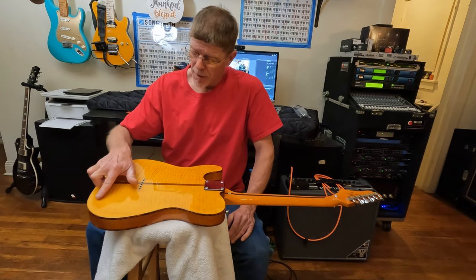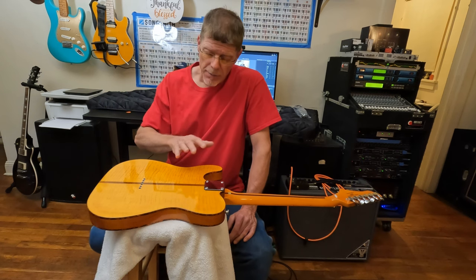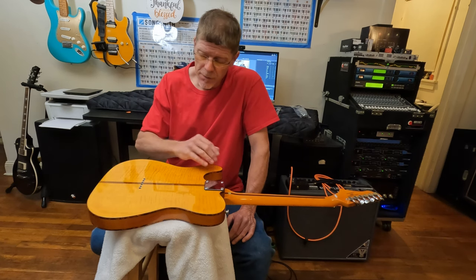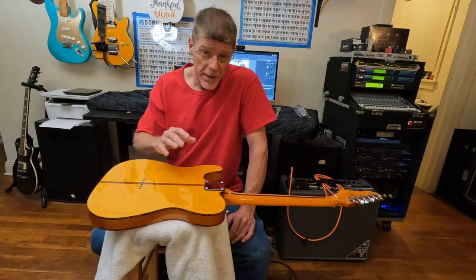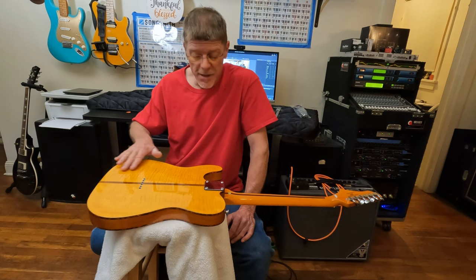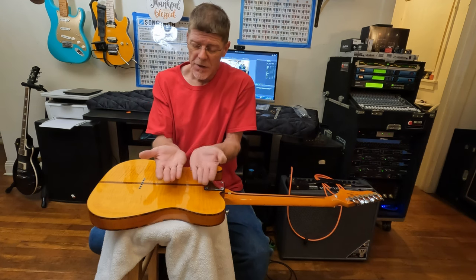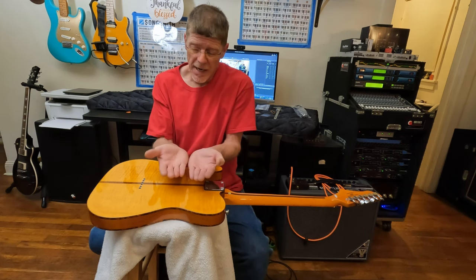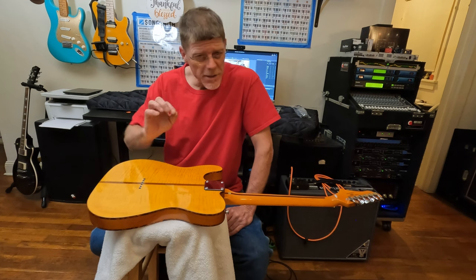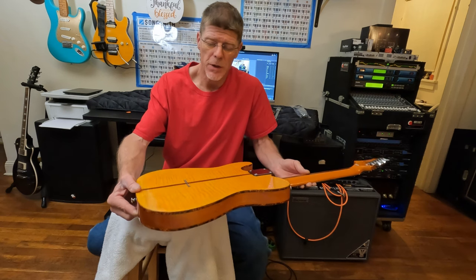I do woodworking. This spot here and these spots in here, I'm not going to say it's a finishing error. Sometimes on these flame tops, when you sand them, certain areas of the wood will take the stain just a little differently. This particular slab on this side has done it very consistently. It's peeled apart like that. If this side does it, you hope this side does the same. In this case, it's done it here and here, and right through here isn't quite the same. It's no fault of Firefly. It's just the piece of wood.